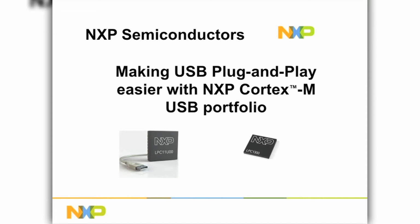This is a very interesting point here. When we move from Cortex-M0 to M3, we offer customers a pin-to-pin compatible version. So if you start from Cortex-M0, there will be a migration path to Cortex-M3. Today, if you start with Cortex-M3, you will have a migration path to M4. And it's not just within the Cortex family. When we moved from ARM7 to Cortex-M3, we offered a migration path from ARM7 to the Cortex-M3 land. So that's one of our key strategies as we grow the ARM-based family.